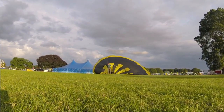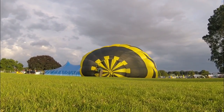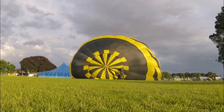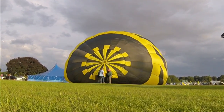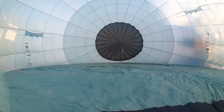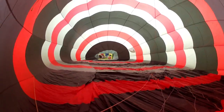While the cold inflation of the balloon is taking place, the team and the pilot will go and access the upper section of the balloon. The parachute is held in place during the cold inflation and the hot inflation using small Velcro tabs. These are positioned around the rim of the parachute and around the rim of the parachute aperture — the hole in the balloon through which the air could escape. During this phase, the weight of the parachute is carried by these small Velcro tabs.